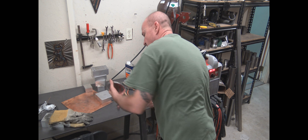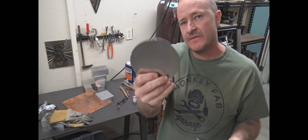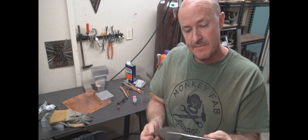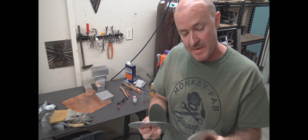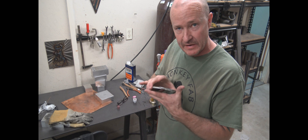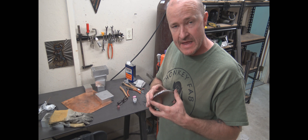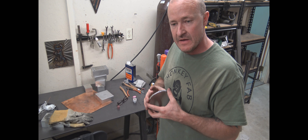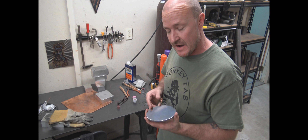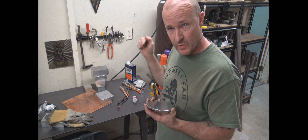I have four of these guys and they are stainless steel — 304 stainless steel — and I have cleaned them up on my abrasive belt and rubbed down some denatured alcohol. We're going to label them: one's going to be number 10 standard, one's going to be number 8 gas lens, one's going to be number 12, and one's going to be number 16.